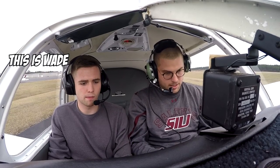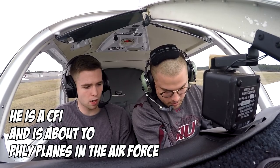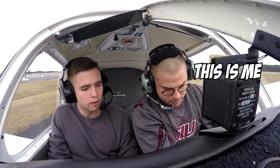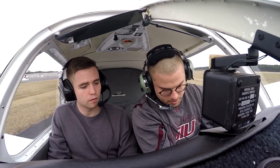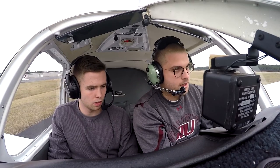Magneto's check. We're going to the right. Yep, go all the way to the right first. Good. Got a nice drop. Can you hear it? Yep. The gauge. Going back to both. Going to left. Good. Got a nice drop, and I can hear it.